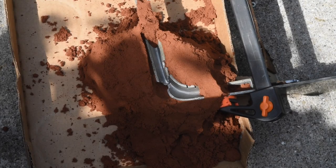This is pretty much the end of the mold and we're about ready to pour. I'm going to check on the state of the metal, give it a quick stir, and see if we're good to go. I might add a little bit of borax just to keep the oxide levels down.